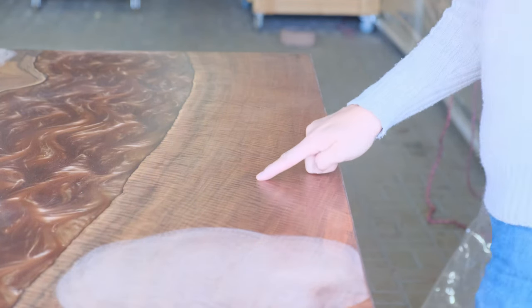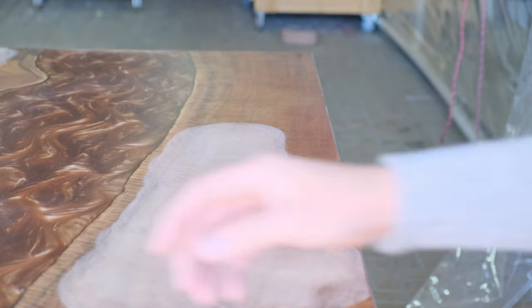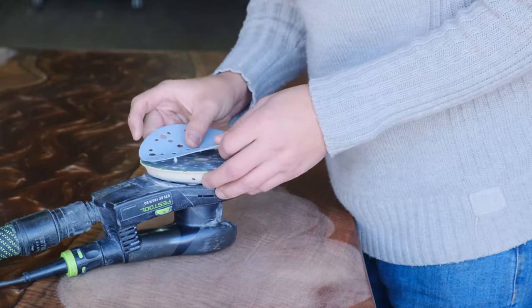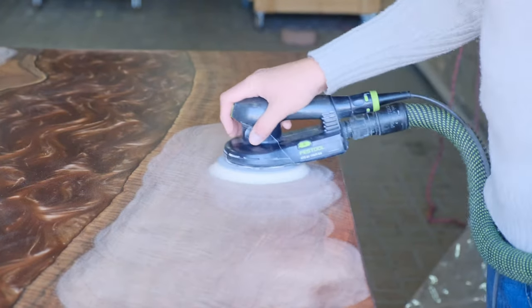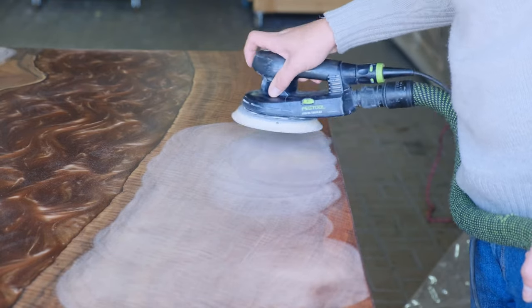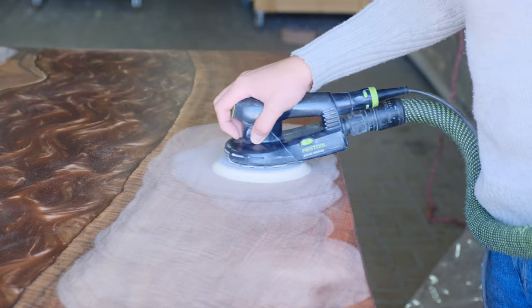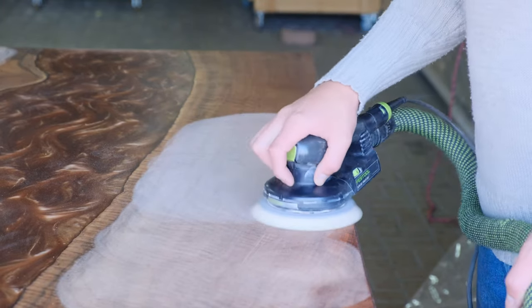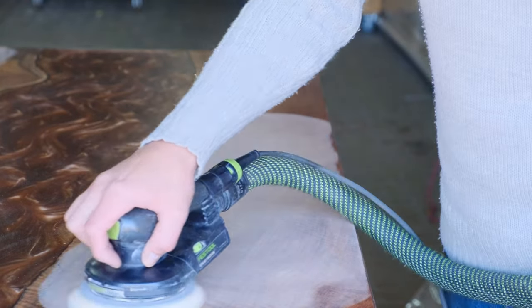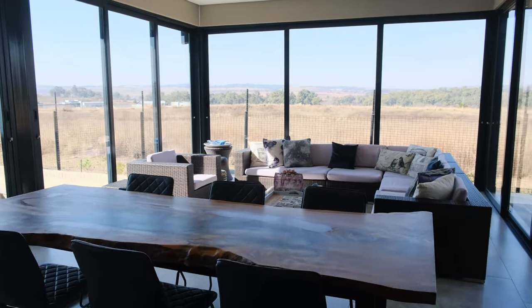This was the mistake I wanted to share with you, because we are not perfect. Those lines I'm pointing out were made by the CNC machine, and this happened because I rushed the sanding process when I started with the 80-grit sandpaper — it leaves those marks when you apply oil. The way we fixed it is you have to go all the way back down to 80-grit and sand all the way up to 400-grit again. That's basically wasting time, wasting product, and wasting oil. The sanding process on your projects is super, super critical. I hope you enjoyed this video — make sure you subscribe to the channel and I'll see you next week with another super cool video.